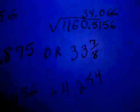So what you need to do is take that corner, because if you don't, it's going to hit the other door when you go to open it. I'm going to take 3/16 off of mine, which will give me 1/8 inch clearance, and I'll show you how I'm going to do that. Here's what I did here. I took the 3/16 off of that, which gave me 33.875, or if you don't know how to figure that out, it's 33 7/8. So now when I build my door, I'm going to cut the edge on a slight angle so it'll clear the other door.